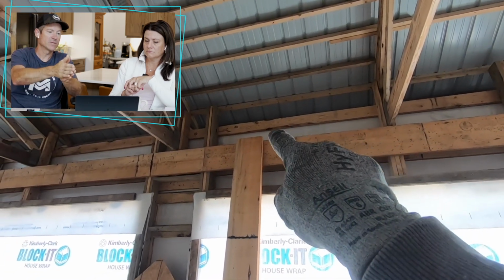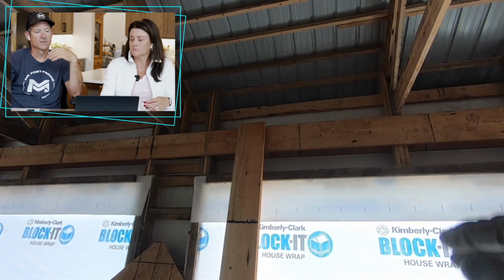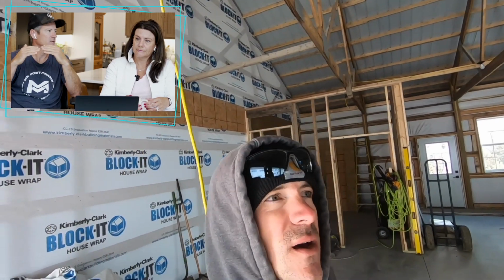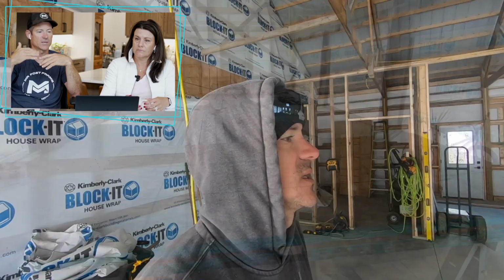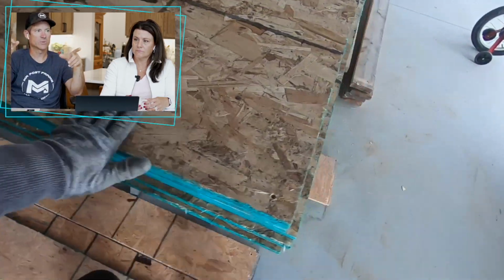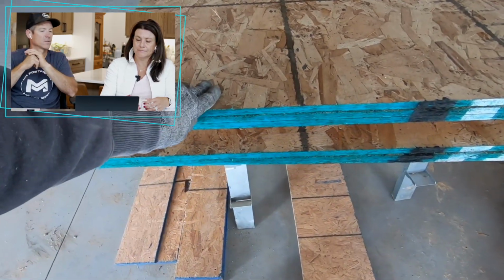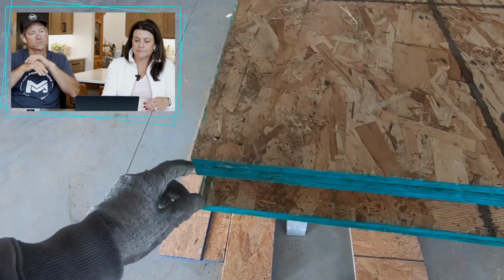The best time to do that is when you're framing, and you can do it from the outside. That's how I did this one this year. And then also at the peak, you run the plywood up where it's almost touching, because that's going to get filled all with spray foam. You're not venting. And then at your gables, you need to block in between your purlins so when he sprays it, he has something to spray to. Right. So those are the only real differences.